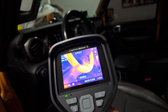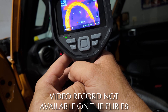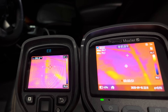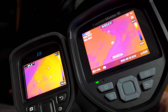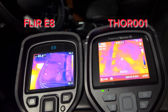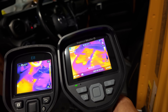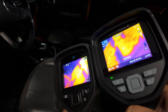Once you're back into the main screen, you can hold the trigger to go into video, or pull a quick click of the trigger for a still picture. We can turn the MSX mode on on the E8 — it helps put things into perspective. It is a little bit better than the Fuse mode on the Thermomaster, but you really don't need it that often. This is made to go quite a distance out, and you'll notice how easy it is to see where you have broken lines in your actual heaters.